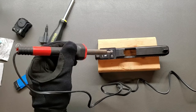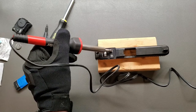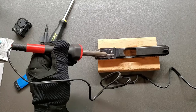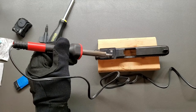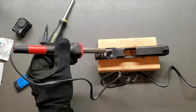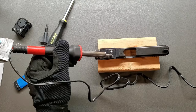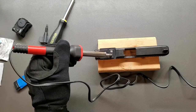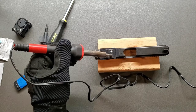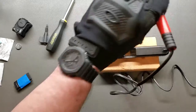I'm not too worried about it because I've managed to get them off relatively easy before. But let's see if applying some heat makes it easier. These were, if you'll recall from that video, torqued to about 11 inch-pounds — so nothing too crazy. A little bit of heat with the gloves on, so if the screws are extra toasty they won't bother me. I'll get a little heat in them from the soldering iron and then I think I'll turn it off — that's good enough.